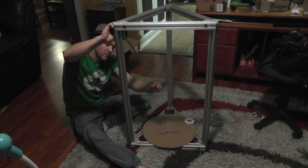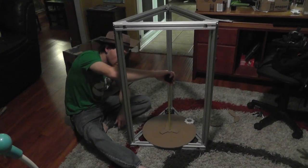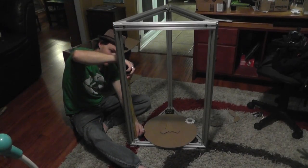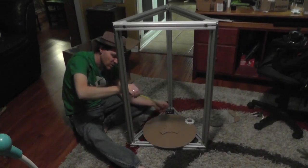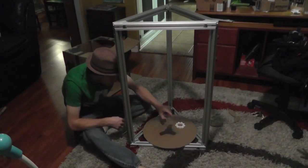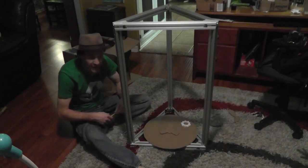You could say 16 inches if you use the end effector to get to the outside footer's point. So that means this arm is going to be straight out and these are going to be at an angle. When you come up here, if you think about it, you're really only going to have wherever the maximum point is — let's just say it was here — then that's approximately 16 inches in height. And then if you wanted to come up higher, so you wanted to make this shorter, let's say if it was only a foot, then you'd actually gain up to 21 inches — you gain about 5 inches there. But when you come down here, you can only reach this far. So you have to think about what you want. Let me get a little bit closer here so I can sort of show you what I'm looking at, and you can help me think through it.